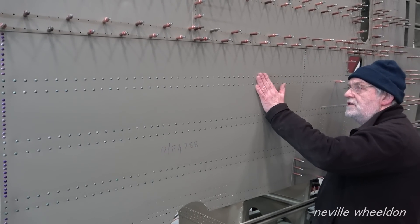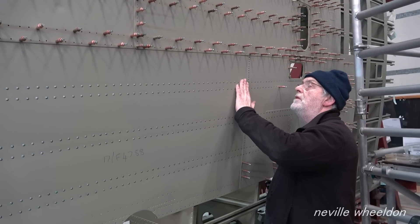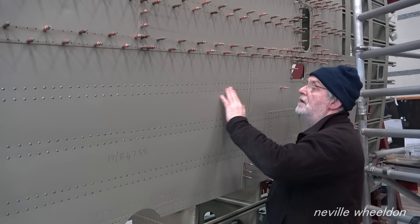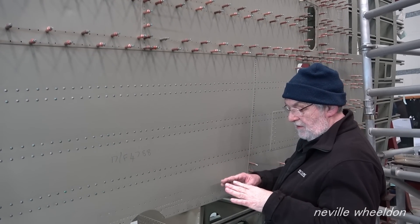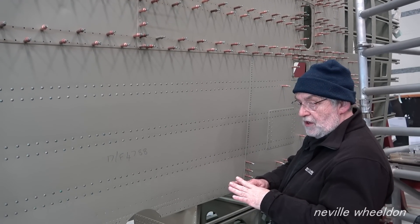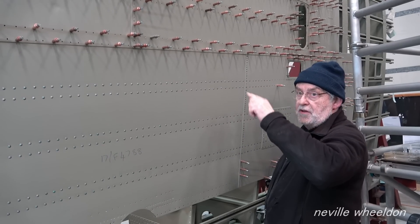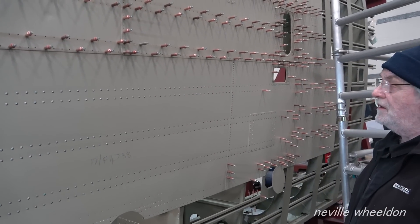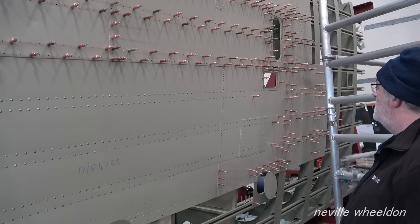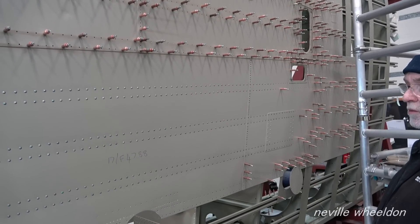Keith dressed all the skins beforehand and took all the little dents out of them. As you knock it flat, it closes the hole up again because the material that's stretched stretches towards the hole. So when you put it in, you just clear it again and you're back to basically starting again. But some of the holes were pretty iffy - not a lot you can do about it.